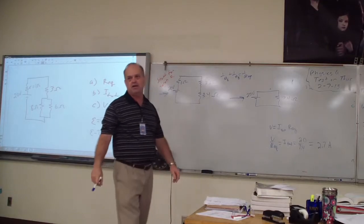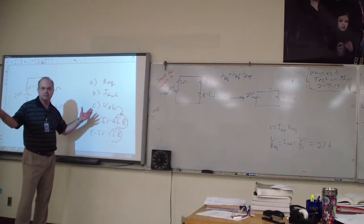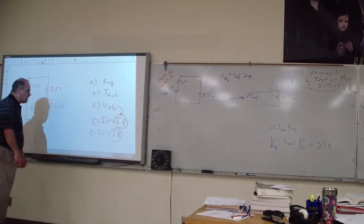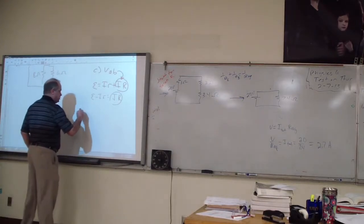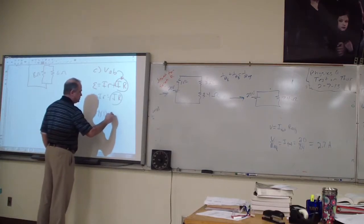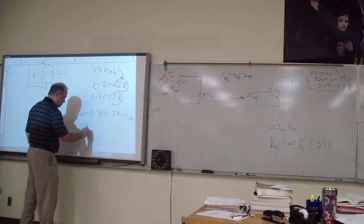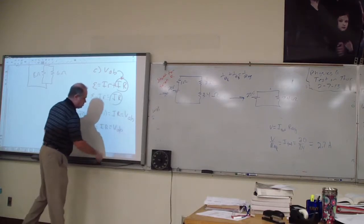But having said that, you don't have to do it that way, do you? You can just plug into this, can't you? Yep. And that's what I'm going to do. I'm plugging in my total current right there, and the EMF minus Ir gives me that. Do we have the EMF? Yeah. EMF is 20. All right, guys, so it's going to be 20 minus I, which is 2.7 times 1, which equals your terminal voltage. So therefore, that's obvious. So it's going to be 17.3. Correct?